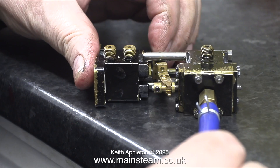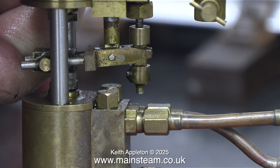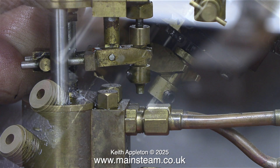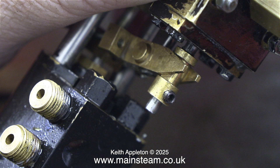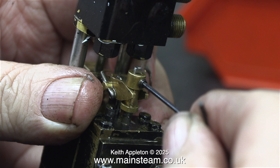I think it's time to have a look at my pump, which was also made by Don English of Jubilee Fittings. The only difference I can see is that the Allen grub screw points towards the piston on mine, whereas on this pump it's sticking out the other way. I don't think this makes a great deal of difference, and it's much easier to adjust when it's pointing this way. Here's a shot of it with the Allen key in place — it wasn't fitted the right way round. The shaft is actually squared off to accommodate the Allen key so it can't slip.